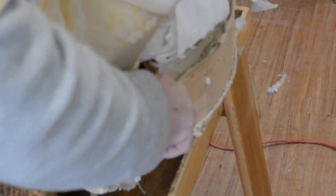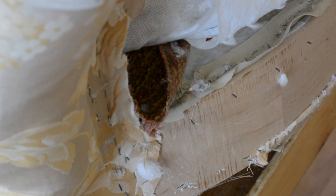Okay, I'm gonna get my staple gun in a minute. This pulls through. I'm gonna staple where the stitching is on both sides. I'm gonna pull it tight. I'm gonna grab my pneumatic staple gun. And then on this side, I'm gonna pull this and staple. I'm gonna go to the other side and pull it, and I'm gonna staple it. What that does is it gets good tension on this seam so that it makes it easy to stitch. Nice tension there, staple, or tack.